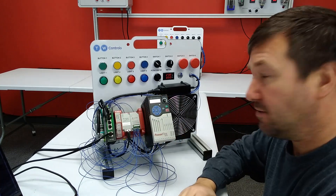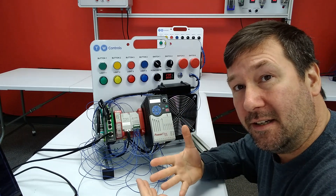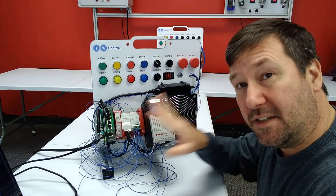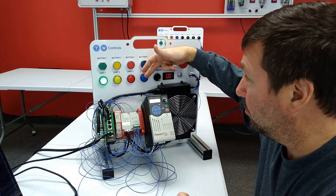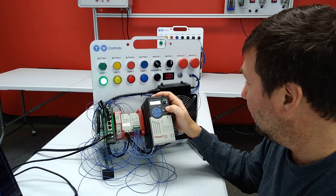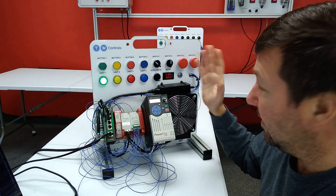Then we're going to escape back to where it shows hertz. Now we should be able to hit the green button and have it start — and it didn't. Don't freak out when it doesn't work. That's because our blue light is flashing, indicating that our safety circuit is good but we need to hit the reset button before it'll run. So we're going to hit the blue button now — the blue light goes out and the green light comes on, signifying that we are ready to roll. So I'm going to hit the green button now — we hear our drive start. And we can hit the red button on the drive and it stops.